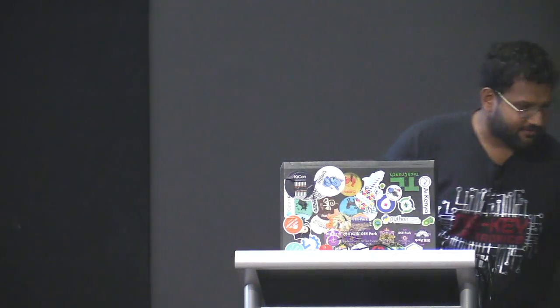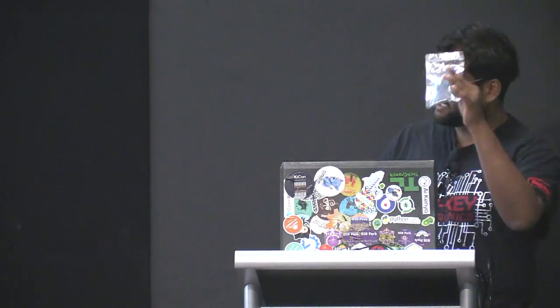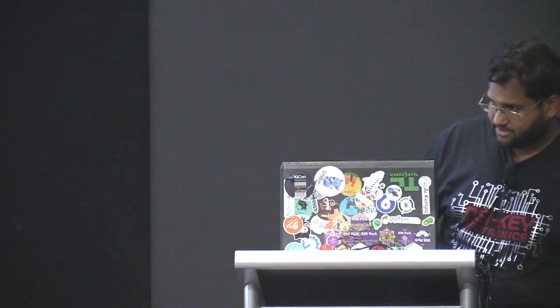Using family connections, my brother-in-law is an electrician, so he installed this on my DIN rail for me. There's a 12-volt DIN rail transformer, and then a current clamp behind, which is sampling the current, and then it goes off to this thing on the side, which has Wi-Fi and the ADCs. I have the newer version of the same here. I have 3 of them, which use a different technique.